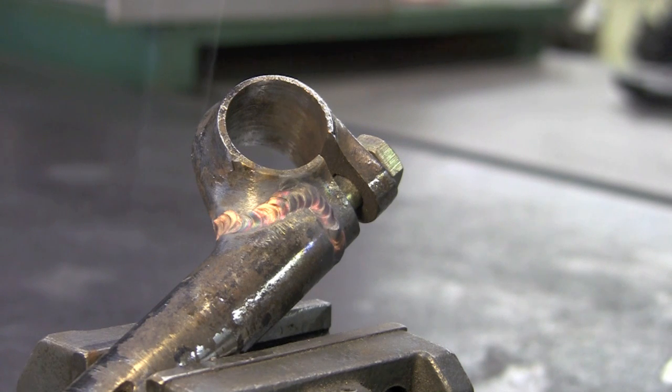I'm going to let this thing come down naturally — I'm not going to dunk it in water or anything like that. From the looks of things, everything stayed pretty straight and accurate. I'll fixture it up, put some bars in it, and make sure everything's straight. You might have to do a little tweaking any time you put heat in something — it's going to pull one way or another. So we'll check that out and get it bent back into shape if necessary. That's it for today's tips and tricks. Thank you for watching Longevity's Welding Channel. I'm Tim Roble and I'll catch you here next time.